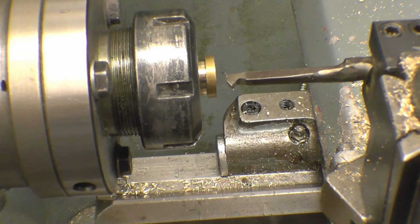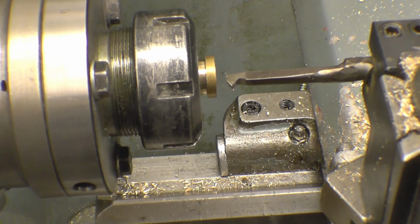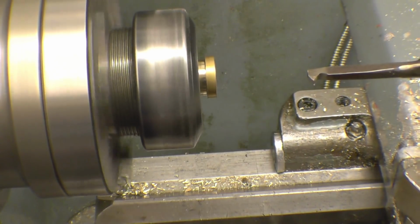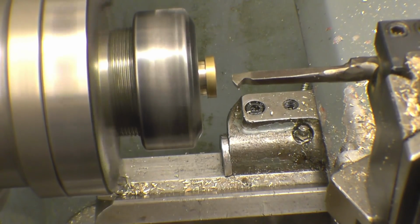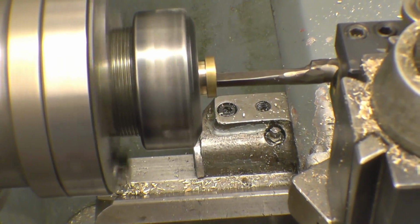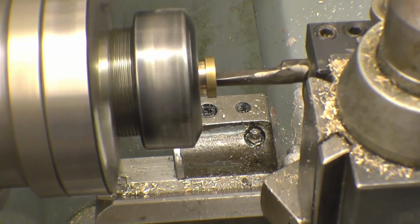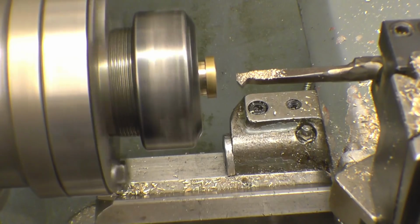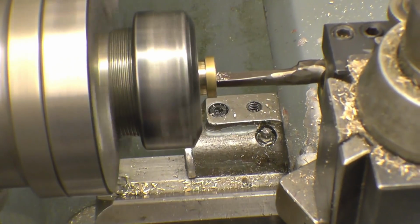All we're going to do is do one pass, disengage the lead screw, wind the cutter into clear, back out again, but it won't take many passes to cut this thread. We'll start it up. That's running fairly quick, but it's not ridiculous, it's certainly controllable. Back out to 0, little bit of cut, so again, a lot of spring on that tool, it's very flexible.